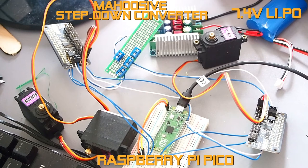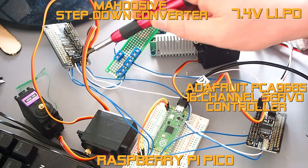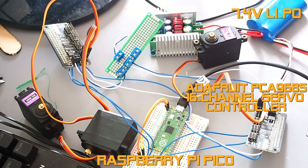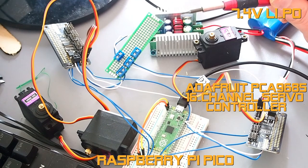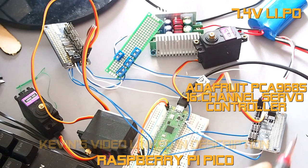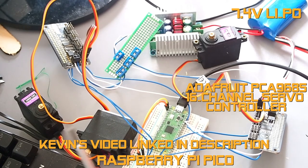This gives me very stable control of the voltage and I can also adjust the current quite a bit. This is feeding two Adafruit PCA9685 boards, designed to drive 16 servos each. These were released for the Raspberry Pi, so the bonnet format seemed like a good idea at the time, but then I got drawn into doing it on the Pico, which seemed more appropriate — the Pico is a lot more affordable for my students to play about with.